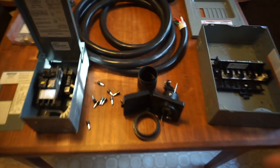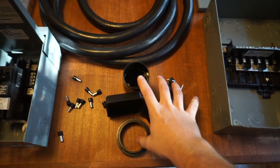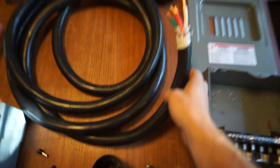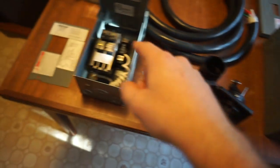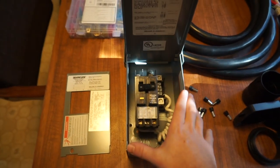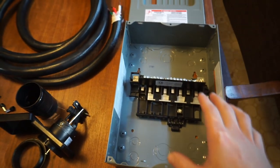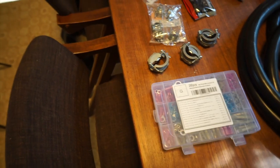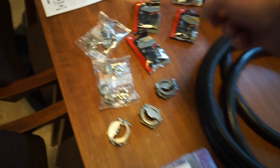I'm going to go inside — I've got everything laid out on a table — to show you exactly what we're going to be putting in. We have our 50 amp power inlet going to get attached to the bus. This is a 50 amp RV extension cable; we just need the cable, not the heads. This will get us power from the inlet to our 50 amp main breaker. Instead of having our main breaker inside the load center, it's basically going to be outside and will then feed power to our load center made by Square D — the QO load center. It's a bit higher end; the breakers are more reliable but cost more. And we've got a bunch of connectors and wire management for our connections.